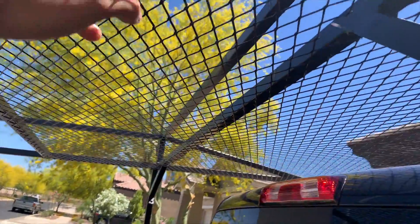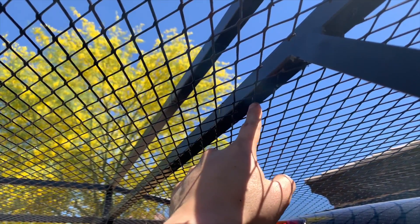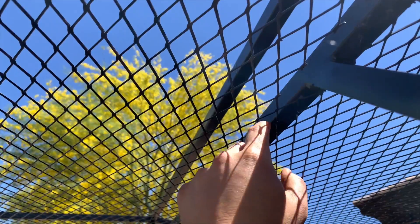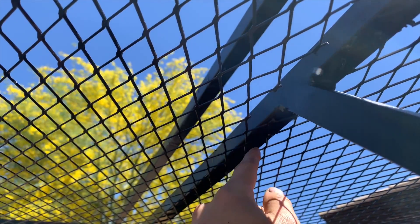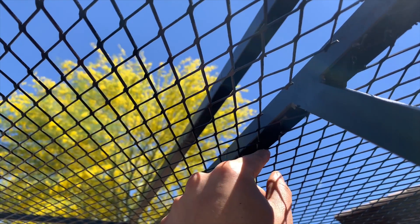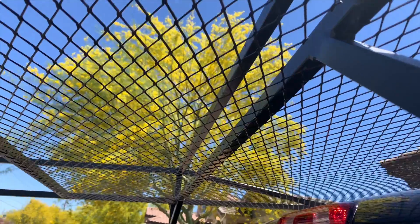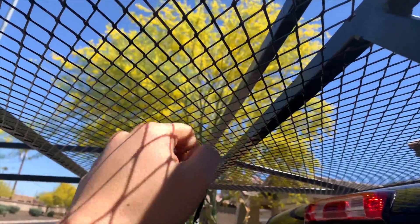The second thing is that if you end up with a rattle, I figured out how to get rid of it reliably. If you tack each of these little thin wires down kind of in the middle on the cross members, it'll hold them in place, but when it actually starts vibrating, that rattle is coming from the little tiny gap at the side of the cross member — even half a centimeter seems to generate a little rattle. The solution is rather than tacking from the bottom, tack it just so it doesn't fall off, but then weld from the top down into the little crack — that completely prevents any rattling.